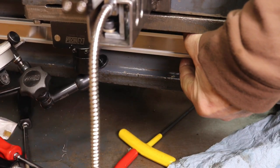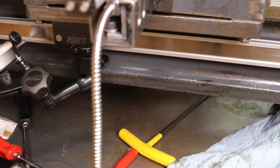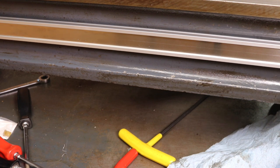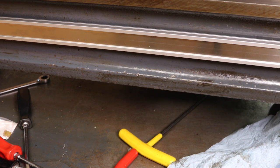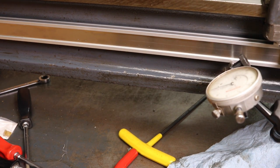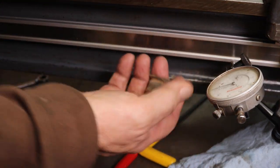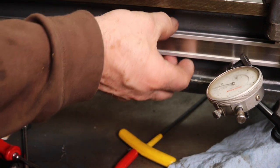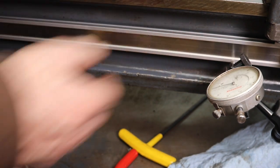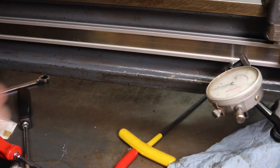There's no support on this end so it's flexible in and out — I'm probably going to be about 10 to 15 thousandths. I'll set the scale off of there, probably at least 20 thousandths clearance, and that in-and-out won't matter that much. If I have a problem I could always shim behind here or flex and bend it a little bit, but I don't think it's going to be a problem at all.